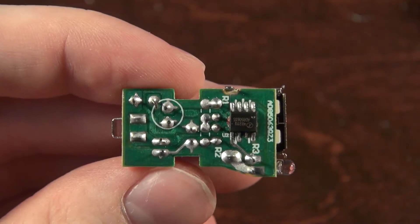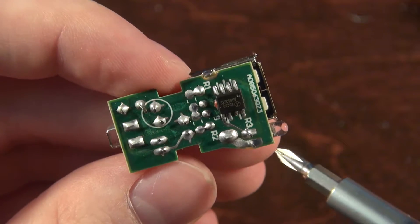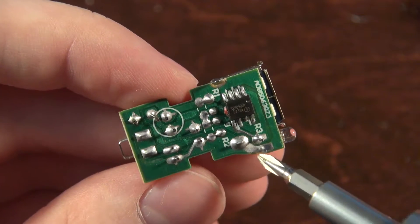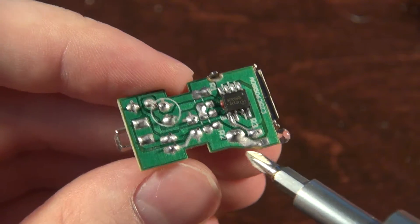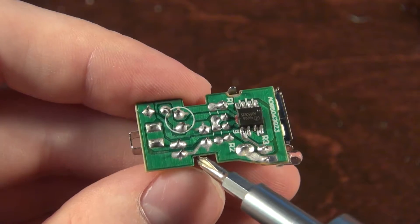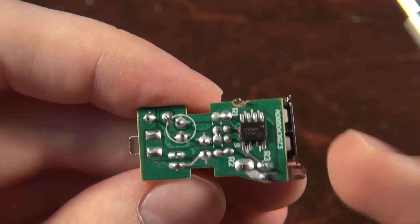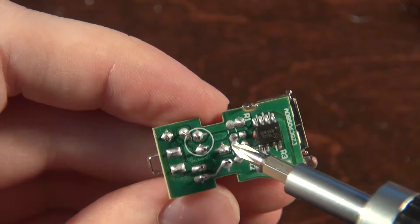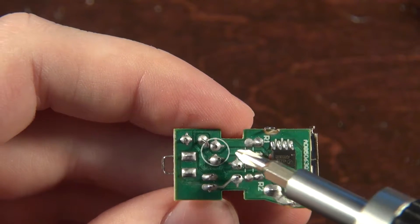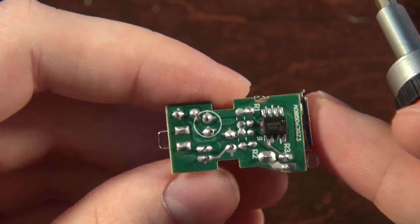What I like on this USB charger is they really tried to provide ample current paths along their tracks here, leaving the solder mask off and letting it just really have all that huge current through the LED and through the charge circuit. They wanted to make sure they had all the current room they could on here. Even on the sense part — it's not even the power — they've got it all well done. There are like spark gaps on here that go to who knows where. It's just really thought-out solder mask.